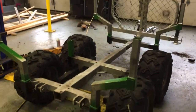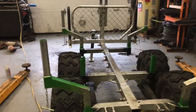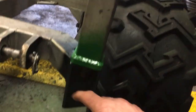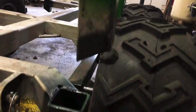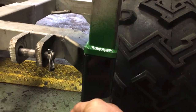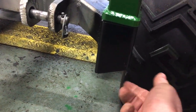So I finally got around to doing a few of the chores on this trailer, as I've alluded to in a previous video. First thing I did was I cut all the old pockets off for these stakes and put new pockets on and angled them. And then of course angled the stakes as well to match, so that gives a little more ground clearance. That seems to be where all of the damage was done, so if I can get that last little bit of inch missing, I think it'll give a little more ground clearance.